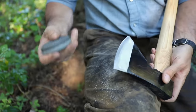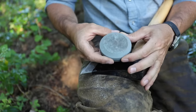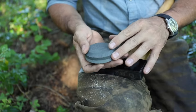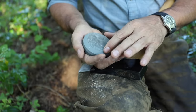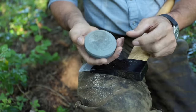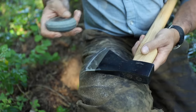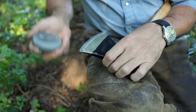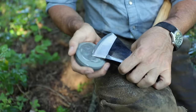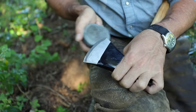If you want to take it to the next level, these Lansky stones are just a wonderful little addition. They're really affordable — I think you can find them on Amazon for four or five dollars or so. They're a wonderful stone; they fit well in the hand. They have a double grit — coarse on one side, fine on the other. They've put a chamfer on the edge so it's a very durable stone, much less likely to get the corners knocked off and broken. It fits in the pocket really well, too. They work well with a little bit of water — kerosene is the best, but just use a little saliva — and we're just going to touch that up real quick.